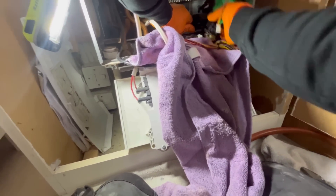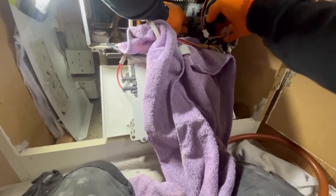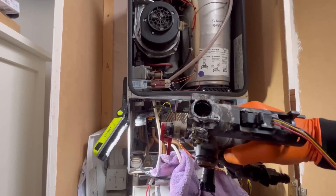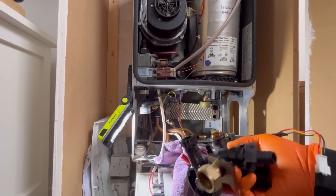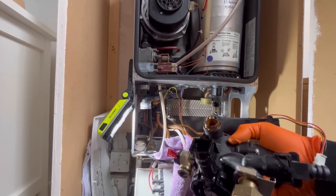It's coming - there you go. That is out, and that is where it's pinholed and leaked. I've got a new PRV as well so I'm replacing that. I've just got to rebuild the new one. That is a belter - look at the size of it. This is what you get in the box - you get a full bag of o-rings and washers, a new right-hand block, and a new diverter valve motor.